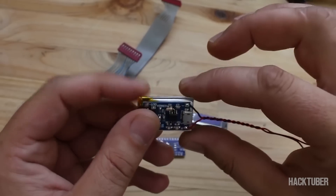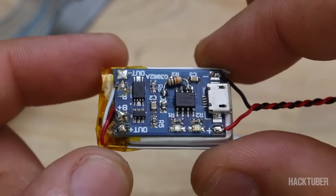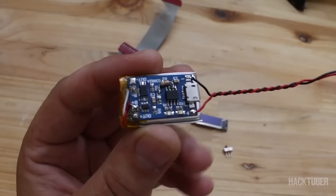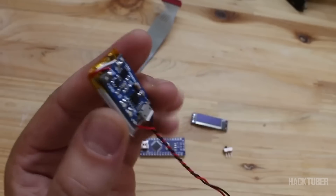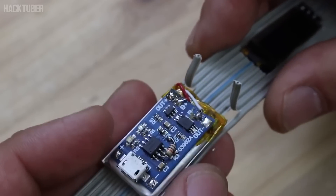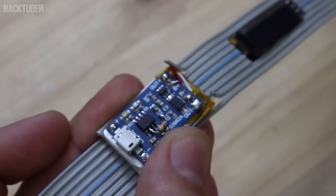I have this small-size lithium-ion battery and on it I have glued a charger module which is USB powered. If you use this charger board, it's nice to replace the current resistor, because by default it is set to charge the battery with 1A and that is too high. I have soldered a 10 kilo-ohm resistor so we can charge the battery with low current, which is the best way for longer battery life.